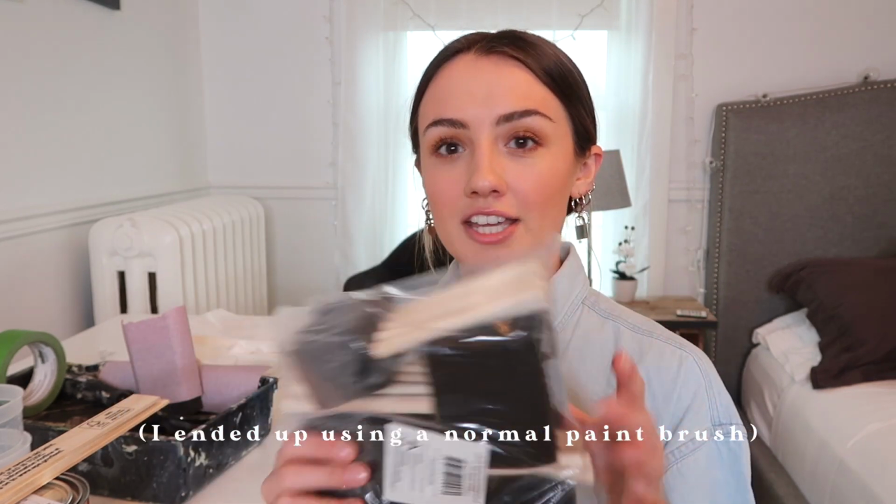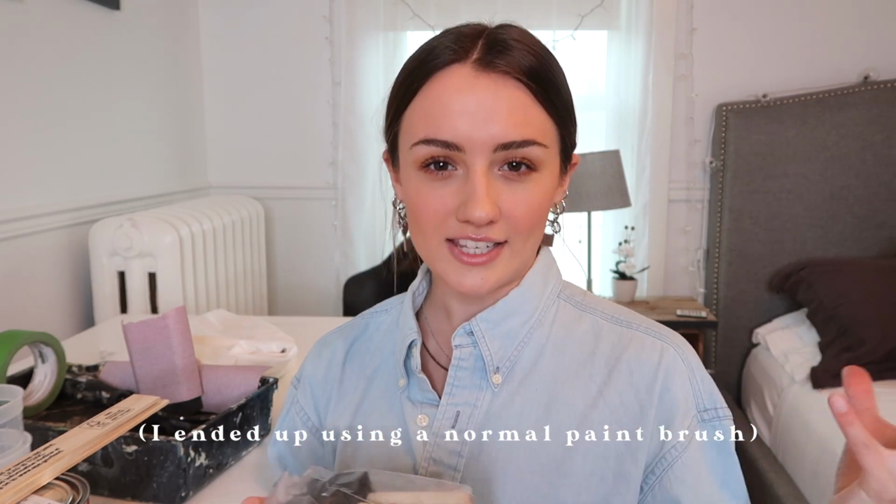Okay, so I'm gonna be starting on my desk and my mom is gonna start with the armoire, but I wanted to hop on and let you know what color we're using and everything I have to paint. So I'm using the color Pewter Green. It's by Sherwin Williams. It's the Snap Dry Interior Exterior Acrylic Latex. I have it in a semi-gloss. Semi-gloss is usually the best for furniture because you don't want anything super flat because it will leave marks, fingerprints. It's just not good for furniture. I'm gonna be rolling the top of the desk and then back brushing with these foam brushes. And then the legs, we'll see what I end up doing, but that's the plan.